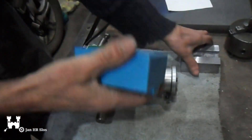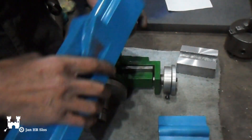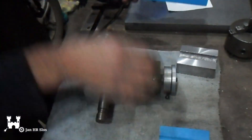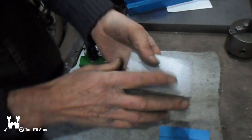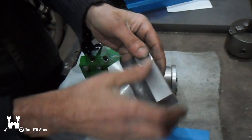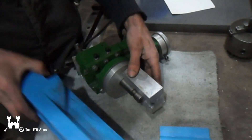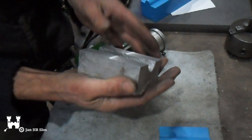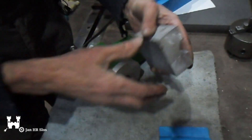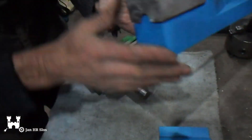I made this block to hold — these two come together. Yesterday I made this block from aluminium cans with my wood furnace. So this comes here, will be bolted, and this will come here. I already started to flatten it. Now I will flatten this side and the back side, but the two other sides I must wait until this is finished, so that I can make them all equal.